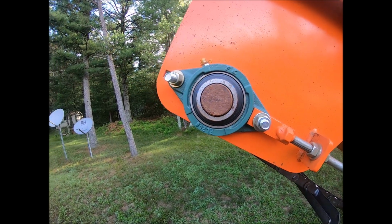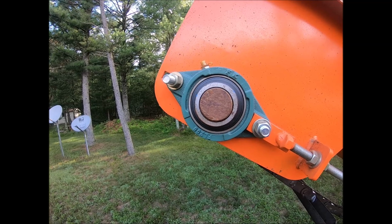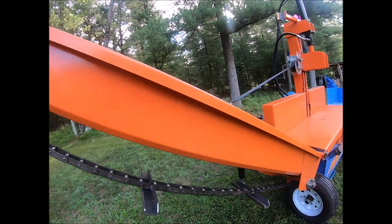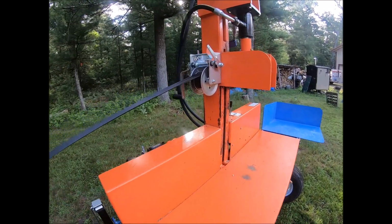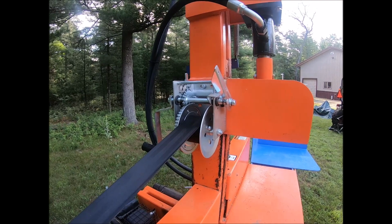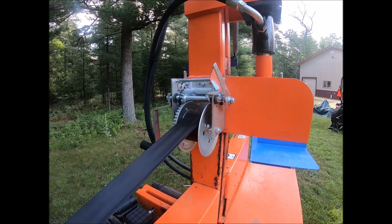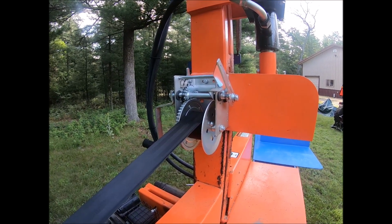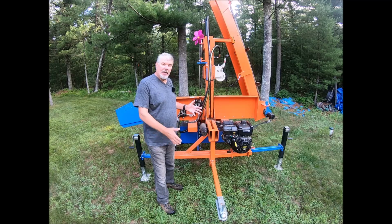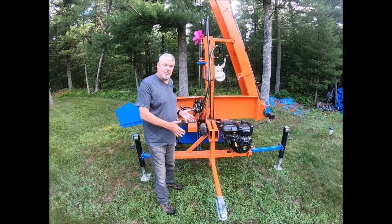Maintenance, as you can see, is easy by squirting some grease in the four Zerk fittings. It is powered by a two-speed winch here. These are very similar to Logrite's winches that they use on their log arches. Very quick and safe. Now we'll start on the powerhouse of the machine, the engine and everything behind the splitter.